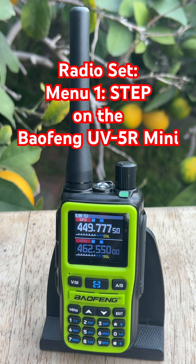If you're unsure what to use, stick with 5 kHz. Switch to 2.5 or 6.25 kHz if you're trying to dial in a frequency with an odd decimal. Bigger steps are only for fast sweeping, but use them carefully or you'll jump right over what you're looking for.